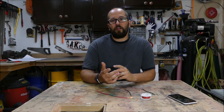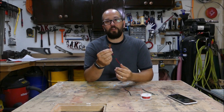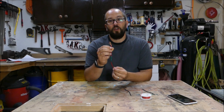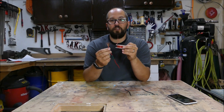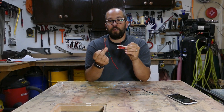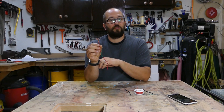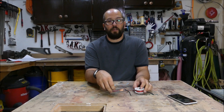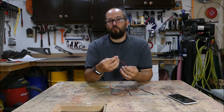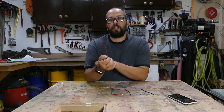The first thing you need to know before you solder wires together is what kind of wire you have. Wire comes in two styles: multi-stranded copper wire, which has anywhere from a couple dozen to a couple hundred individual strands of copper depending on the quality and size, or solid core wire where the entire wire is one solid piece. Multi-strand wire is much more flexible — this is what's used in automobiles because it allows the wire to flex without breaking. In houses and components that don't have any movement, single strand or solid core wire is often used because it's less expensive to produce.